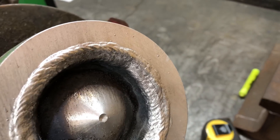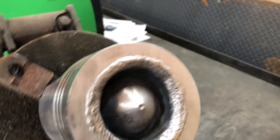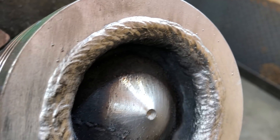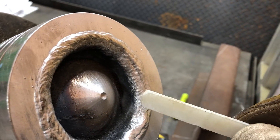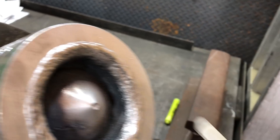You can see the ripples of the double pulse right here — how nice and cool this lays down. Then we need to restore basically this sharp edge here. So what we need to do is put a weld right on the outside here. It needs to be a cold enough weld where it can just build up and stick out.